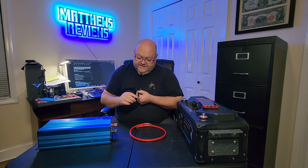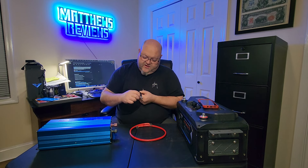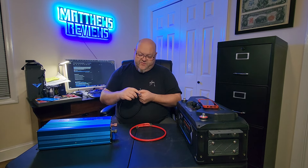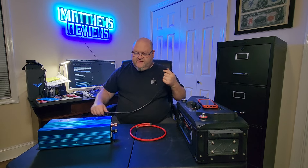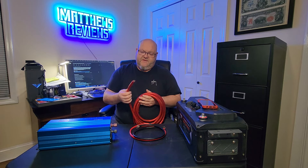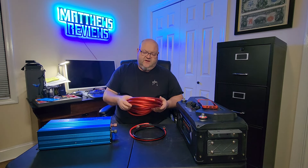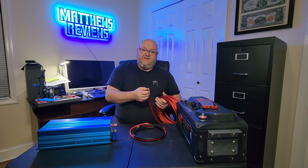So that's what we're going to test it with. I did take a pair of pliers and scratched the coating off that lug — it is a copper lug with a tin coating over top of it. We're going to go ahead and get this inverter hooked up, but I just want to pre-warn you about the cables — definitely upgrade them. With all my 12-volt builds, I always use New Concepts wire. This is one-ought wire and it has 5,140 strands of oxygen-free copper — this is the best wire you can get.